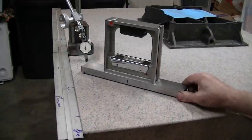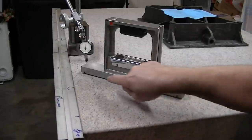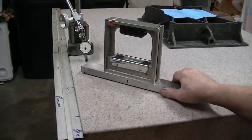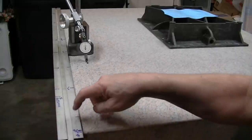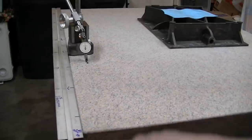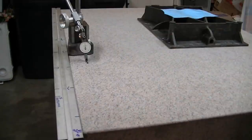Now, the 11-inch spacing that I'm using on the level that you see here is working wonderful as far as general contour and seeing what's going on in general. But you have to remember that when you do that, there are things that can happen within this spacing that you're not aware of. And I just want to show you one of those things. Focusing on this, the plate now, if I measure at these points, is down to about 3/10 overall bow on all the perimeter, just going on the perimeter, doing each edge. We're only talking about 3/10.